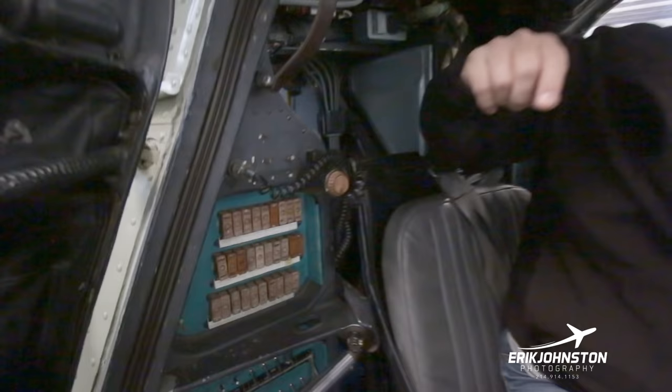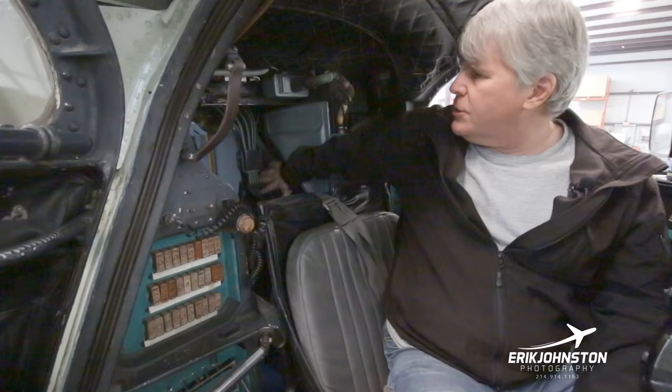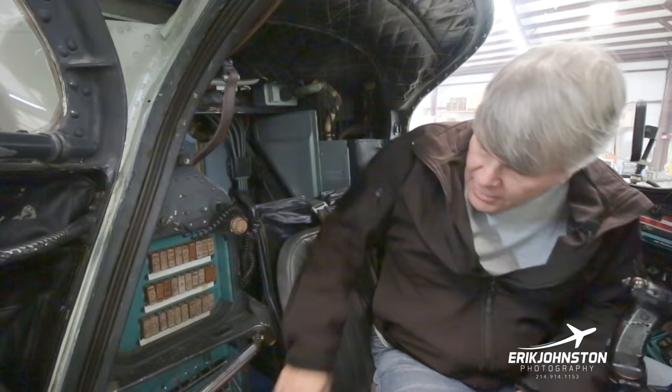So he can crane around, look in here, pull the fuse, look at the value, and typically go in the back and find there's additional fuses on this wall over here. He can find fuses that aren't currently in use or that we're not going to be using in flight. He can swap the fuse out if that's needed in flight. These down here are circuit breakers. We bring all the circuit breakers on like so.